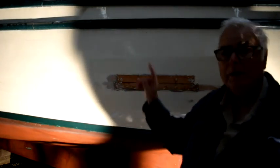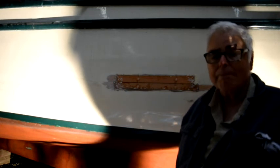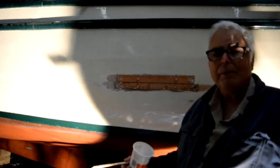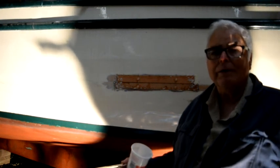So anyway, as of today, October 13, I have now repaired these two punky plank edges and removed punky wood on the other side and installed a joining piece that's scarfed in on both ends, to replace bad wood and a butt block. And that's all there is to it — time to end the video. Thank you for watching, hope you enjoyed it. If you haven't, please subscribe to my channel, give me a thumbs up, and don't forget to click that notification bell. Thanks again for watching.